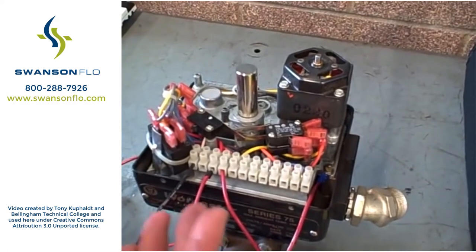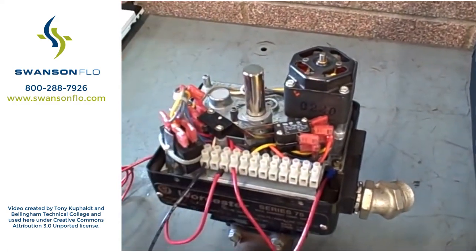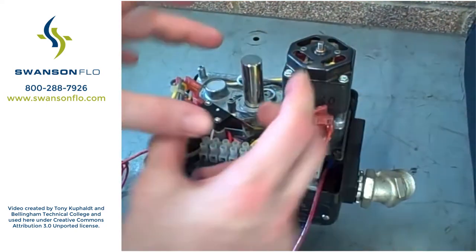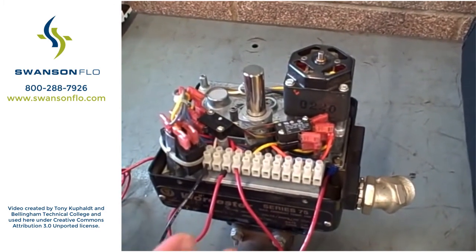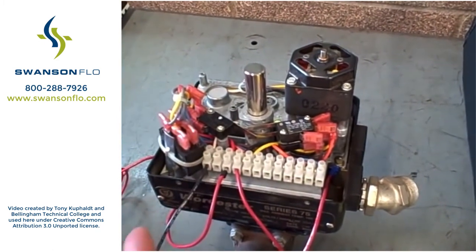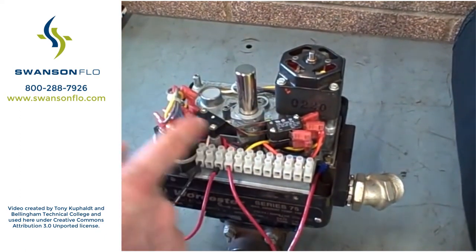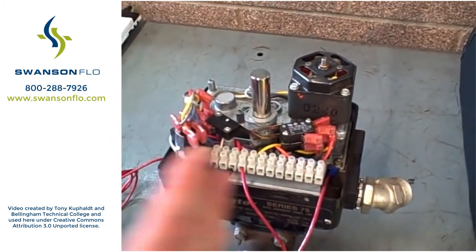This is a simple full bore ball valve, so we're looking for 90-degree rotation — you'll find these cams offset by 90 degrees. However, if you wanted to limit how far the valve opens, let's say not go all the way open or not go all the way closed, you can change the positioning of those cams and force it to do whatever you wish. Now with larger MOVs, you're not going to find cam arrangements that are quite this crude. You'll find much more sophisticated styles of limit switches, but they all work on basically the same principle. The limit switch somehow monitors mechanically the position of the valve and then will open or close a contact to stop that valve's motion before it gets too far.